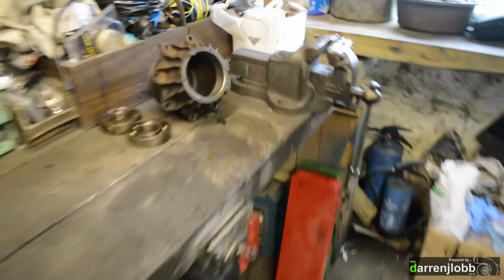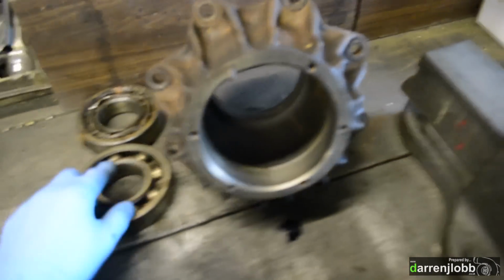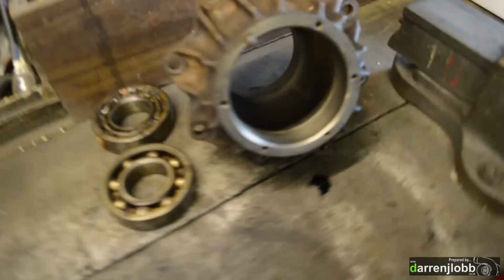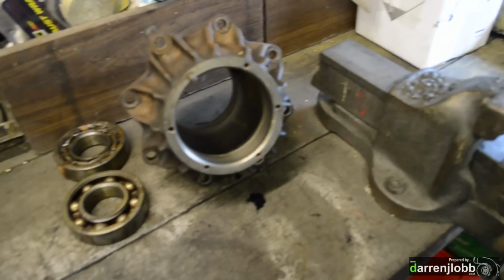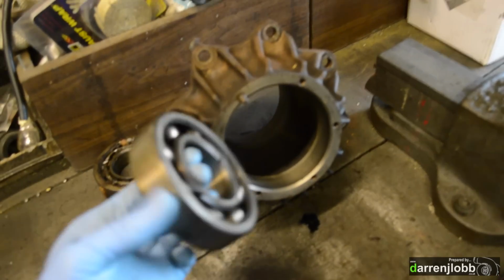And over here you can see everything that we've taken apart. In the very centre you had this big central core, which I thought was greased, but it isn't actually. It's open bearings with an oil-filled core with two lip seals that sit on the outside. Quite evidently this hasn't had any oil for many years. Both bearings are completely dry, rusted out. The outside one is still sort of functional, but it's horribly noisy and there's play in it.